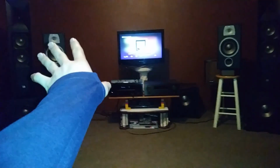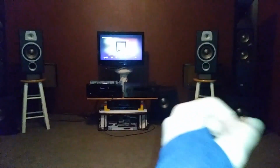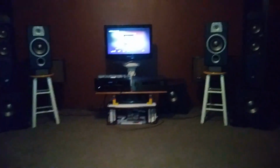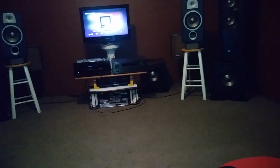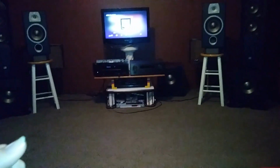So I had them in my living room with a 100-watt audio source amp, and the left-right output of the amp went into a subwoofer, the PS28, and I had the subwoofer play up to like 70 hertz or something like that. It was blended, kind of like a 2.5 way basically. And the subwoofer worked so perfectly with these speakers. It sounded like they were meant to go together because they're all 8 inches. That subwoofer's cone is made of CMMD, an aluminum composite material, and they work together so well. I kind of miss that setup.